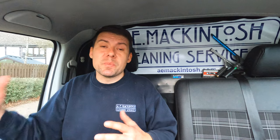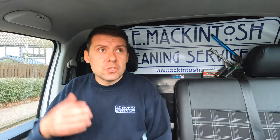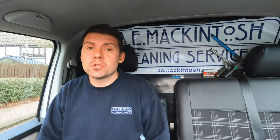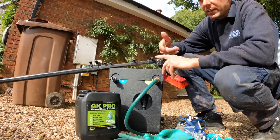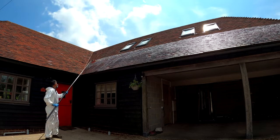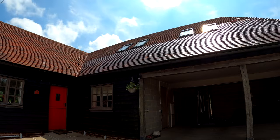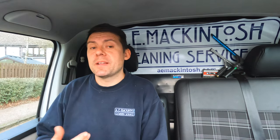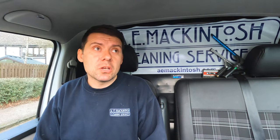I really recommend the biocide treatment, but you need to be careful about chemicals you use on the roof and drainage. Drainage from guttering usually goes off into a local watercourse - a local river or stream - so you don't want to be using a lot of harsh chemicals. I personally never use hypo on a roof. A lot of guys use that as a soft wash, but on a roof I only ever use biocide. Apply the biocide from the bottom working upwards so you get very little runoff. You can also detach the guttering to catch any runoff. The biocide is biodegradable, sits on the roof, acts as a preventative, and should last a couple of years - you could reapply every three or four years.